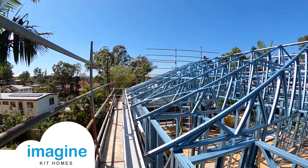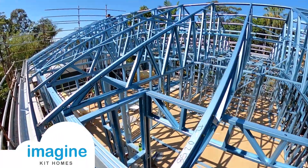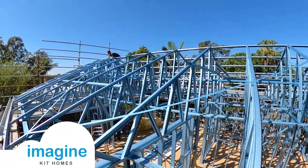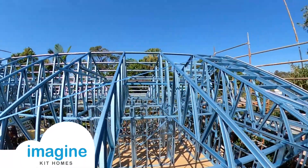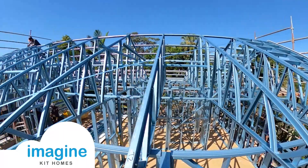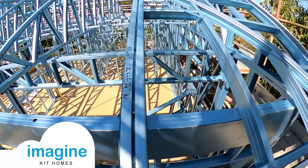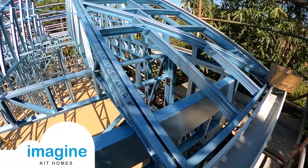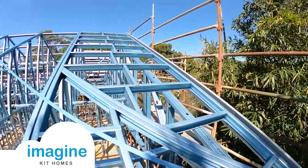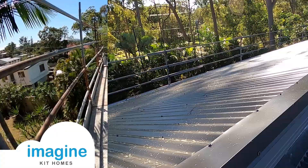This roof only took a couple of days to set up — you can see it's a long way up. They're just going to put the roof battens on today, which are these 44 mil top hat sections. It's been strapped and braced, and you can see we use a truss for the main part of the house. On the ends it's got what we call a roof panel, which is basically the same as a wall panel or wall frame — it just lays on the end to create an extra bit of strength, and then the battens go over the top and tie it all in together.